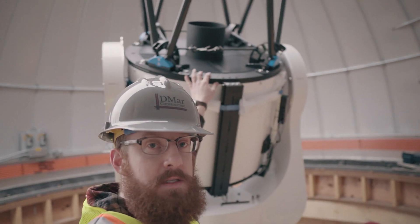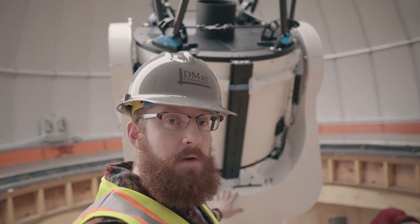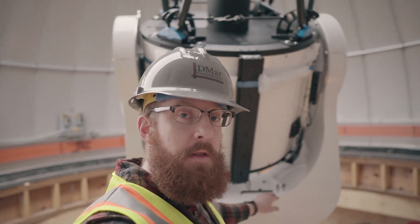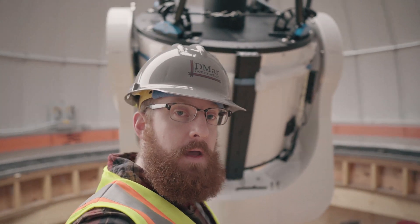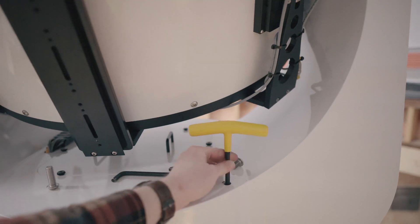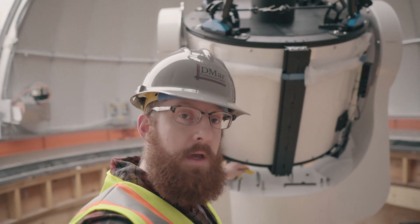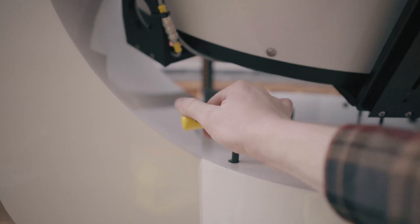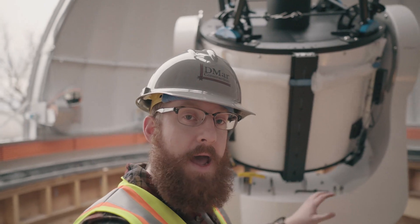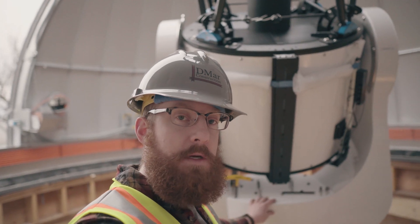The altitude axis has been tightened down with the bolts. Now we're going to loosen the azimuth locking bolts. We took out the bolts covering these holes and we have our T-handle — sometimes you have to seat it down a few times before you find the bolt hole. We'll loosen all four, and that's going to free up the azimuth locking system, which prevents it from being damaged during shipment.